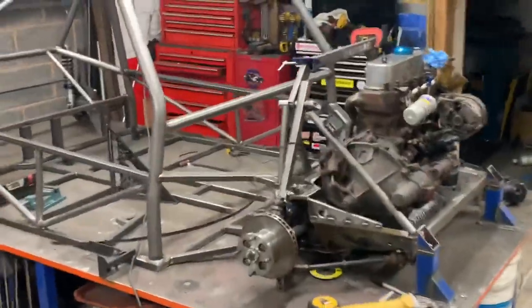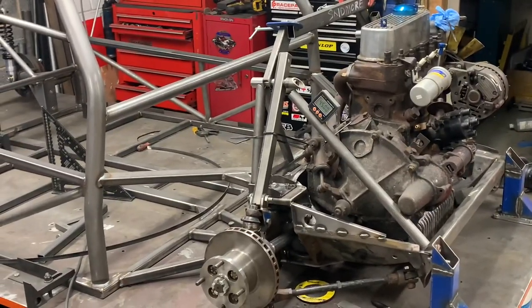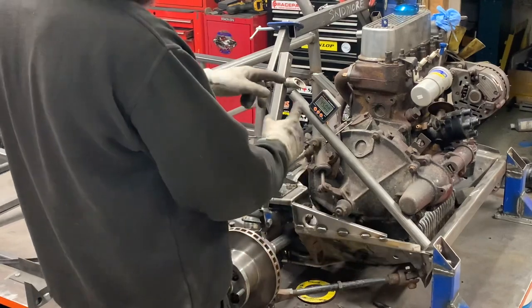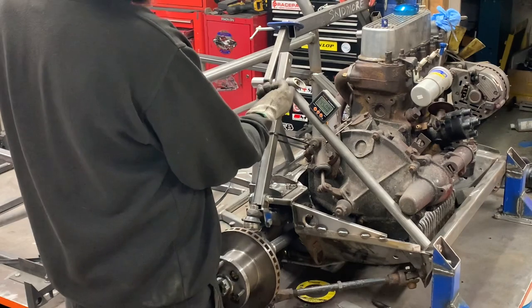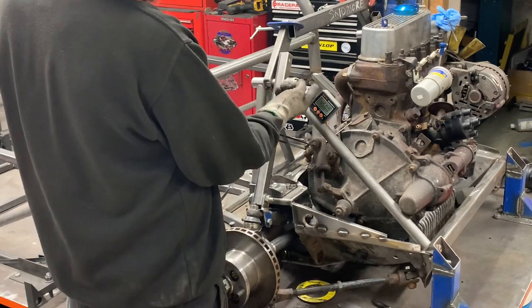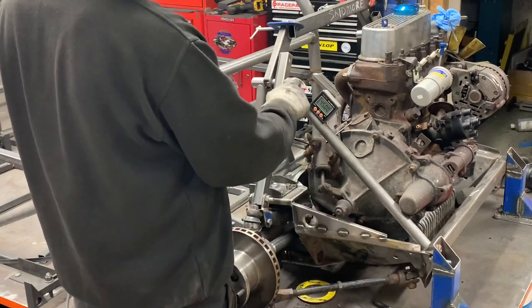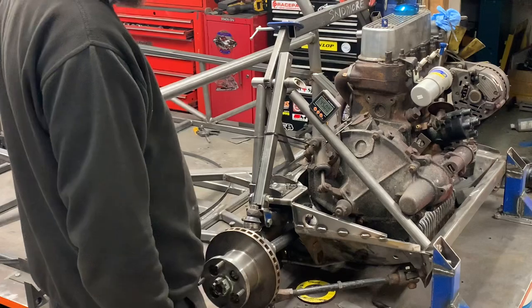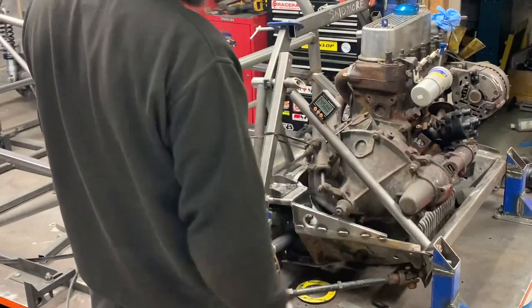All right, so I've cut my tube, 18.5 inches. I'm going to run it at a 45 degree angle. And the way I did that, if that's a 45, I'm taking it off this. So I took that as my zero point, and that's my 45, right? To this, I'm going to notch a 45, notch a 45, and then we'll make another one like that, just for the bottom that'll bolt straight through to the subframe.